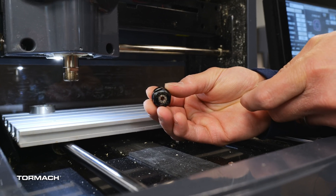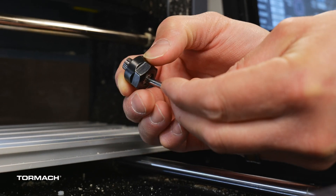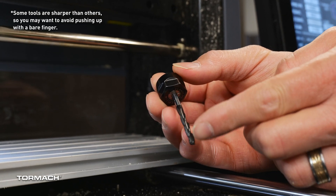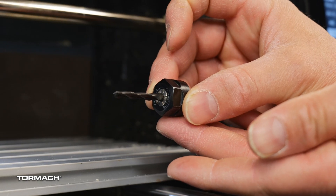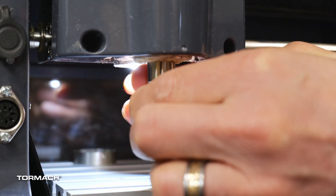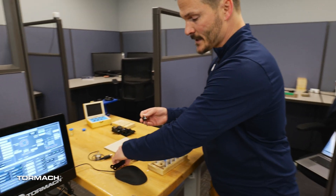You'll start off with a 4mm collet. To place the collet inside, they'll easily press in and snap into your collet nut. Once in, you can slide the tool into your collet. It's important that when you place the tool into the collet, you press and make sure it is as far up into the collet as possible, where your flutes start to meet the shank. Once that's done, you can easily load the collet into the holder or into the machine, and then lock it in place with the wrenches.